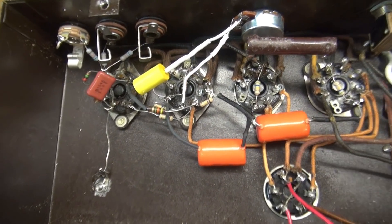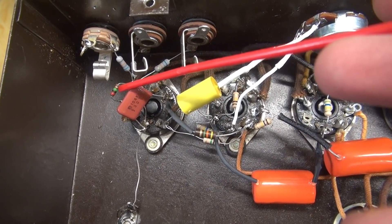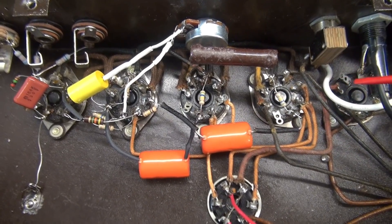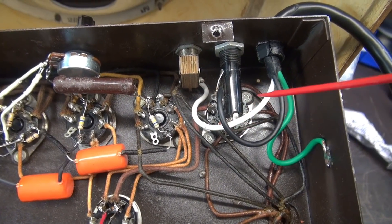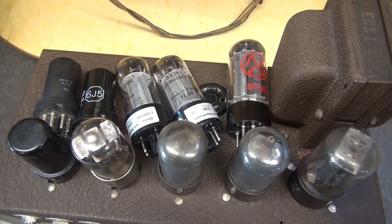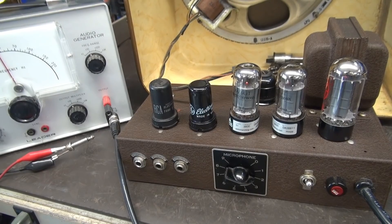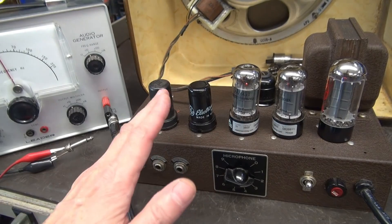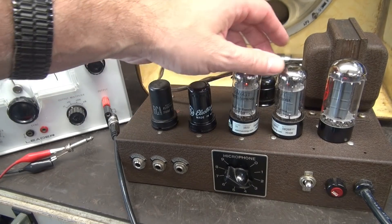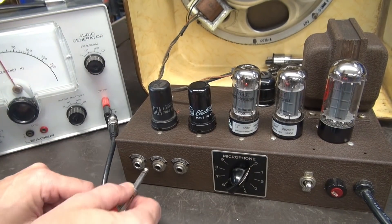Mission accomplished. Everything's rewired. Now I have 68K resistors all joining to the input of the preamp tube. Following the preamp tube now is the volume control. Got all the new caps in here, proper value. I fixed the AC line mess. It's ready to fire up. For the final test, I'm going to go ahead and install the new tubes — because we know that middle one is noisy, no reason to do the final test with old tubes. Got the new tubes installed, amp is on. Bring up a little bit of volume. Let's see if we have any spurious noises when I move things. We don't.